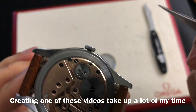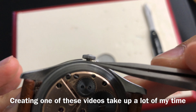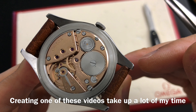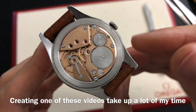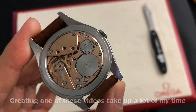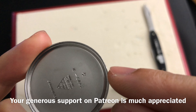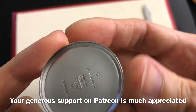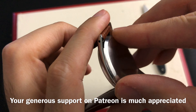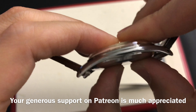So why are there so few of these jumbo size watches? The cases are not moisture resistant. Something to watch for is the case tube, which is usually missing or filed down. This is because when a watchmaker replaces the crown, it is very difficult to find a substitute crown to properly fit onto this case tube. So instead, the watchmaker will just file it down to randomly fit a new crown. On the edge of the case back you will find this filed down area. Make sure you set this area on the opposite side of the crown when closing the case back. This edge will show a small gap opening which allows a knife to slide in and pop open the case back.